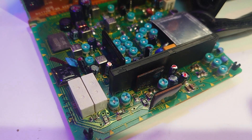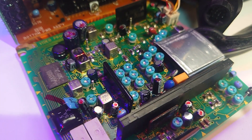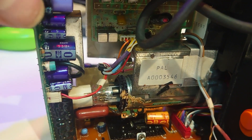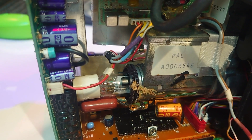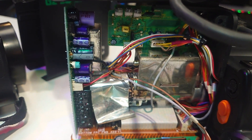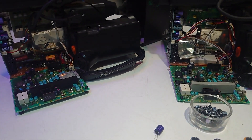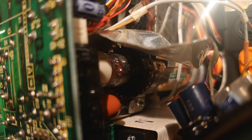So this will have to be part one of a two-part video. Hopefully in the future I'll get a service manual and then we can look at these three cameras further. If anybody else has had any experience with these cameras and knows of any problems they may have, please let me know in the comments. All three tubes in these cameras are lighting up fine — orange as they should be, not too bright, and no purpling which usually means they've gone.